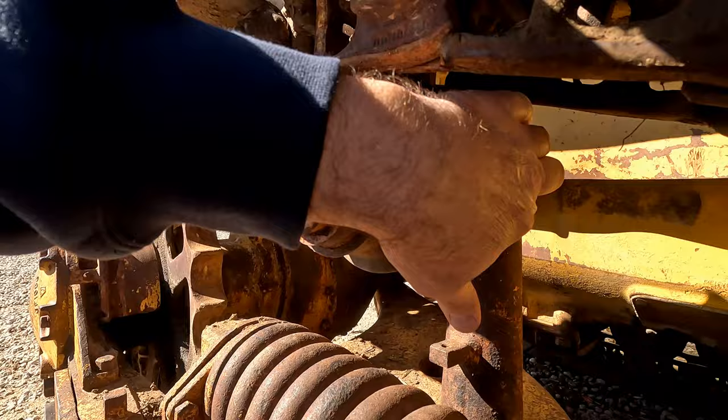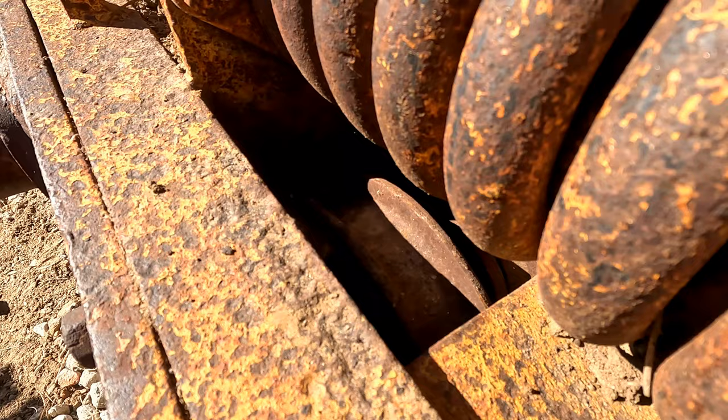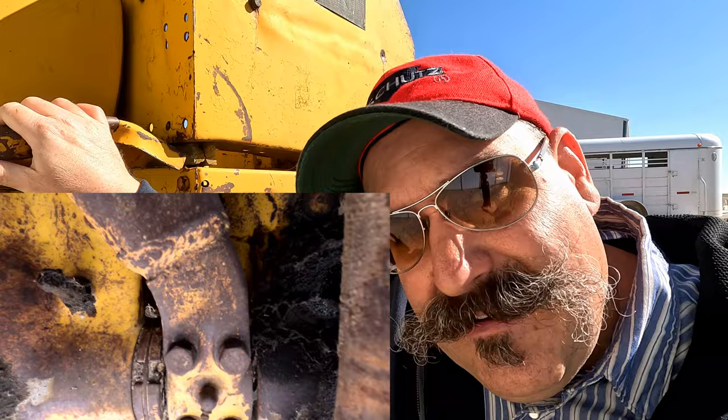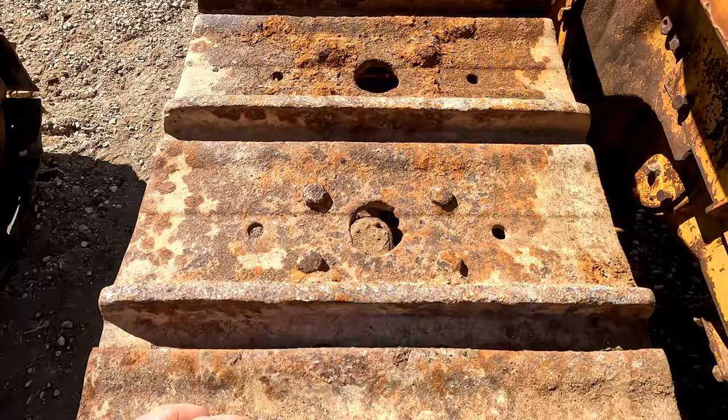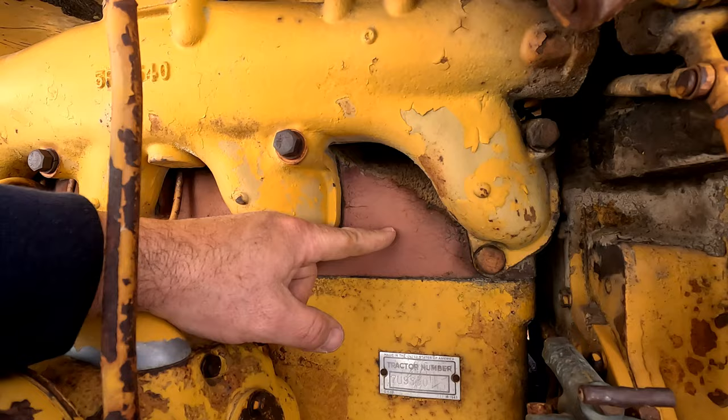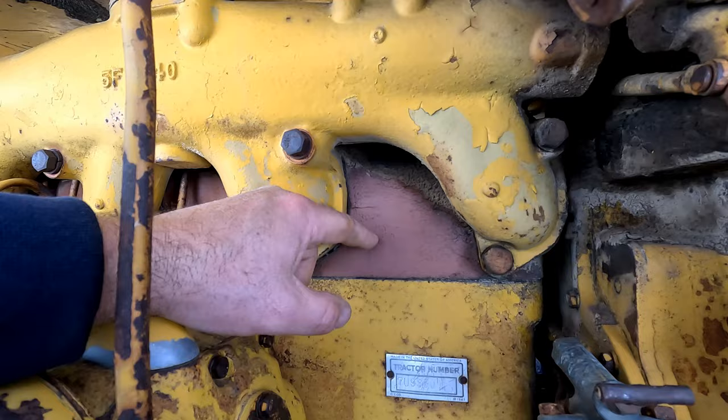This side has a little bit more wear and grooves in it. Rollers not terrible — they've definitely seen better days, but they're still serviceable. I do not seem to see any repairs on the track frames — that was a popular thing especially on dozers. Interesting to note that these grousers have also been cut out. You can tell a Colorado machine — they're worried about snow getting in there and throwing the track off, so that was a common thing folks did with the old cutting torch. Engine is a matching engine block number. This head does appear to have been replaced — we've noticed that this primer color on here is indicative of that. We've actually encountered this on a couple other machines.